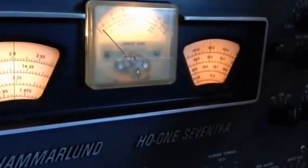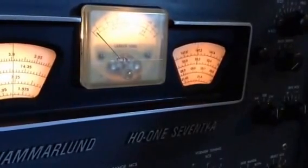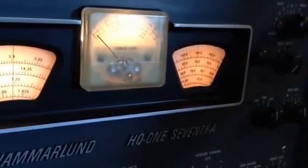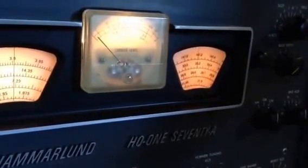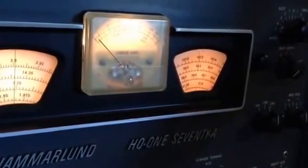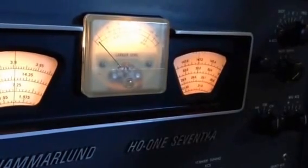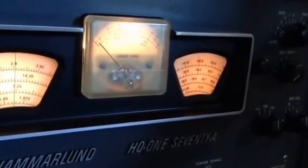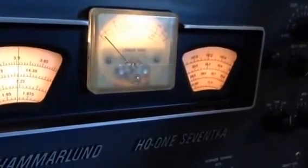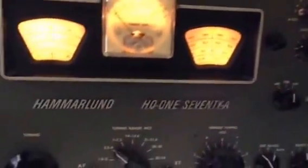This particular one is fairly symmetrical — we knew that going in because the S meter at center frequency reads pretty much the same between upper and lower sideband, so both sidebands are pretty well balanced. What isn't balanced is how well they actually reject the opposite sideband.